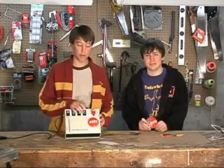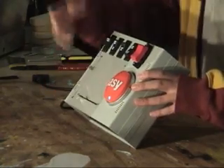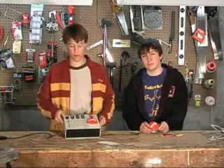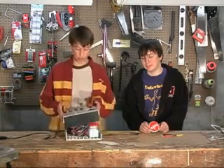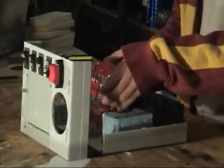This is Team 177's 2006 Operator Box. It has four switches up here that were used to control the harvesting mechanism, a slider down here used to aim the turret, a rocker switch for agitation, as well as an easy button which fires the ball straight into the goal. Inside this box you'll see it's kind of a rat's nest of wires, but once you start to actually look at how it works, things are a little bit less complicated than they seem.